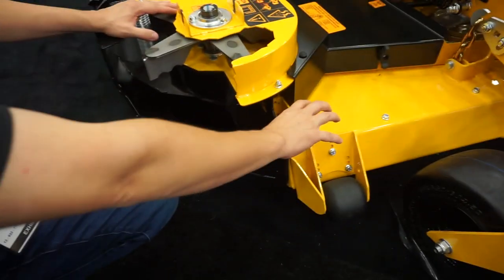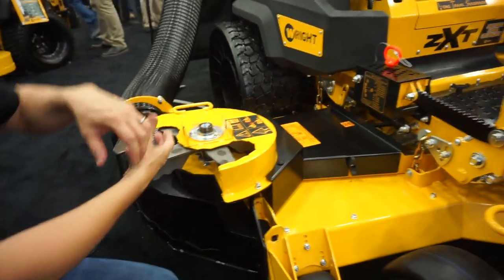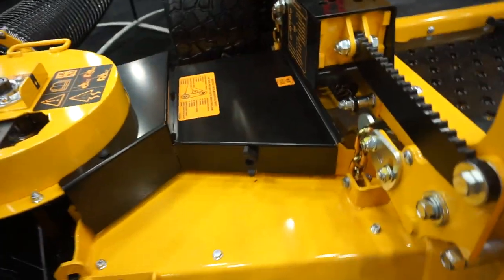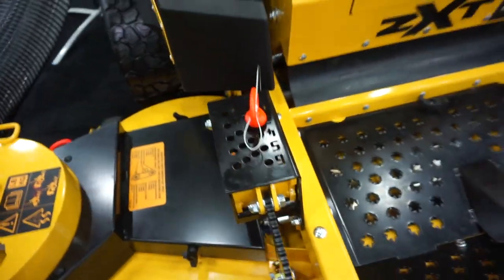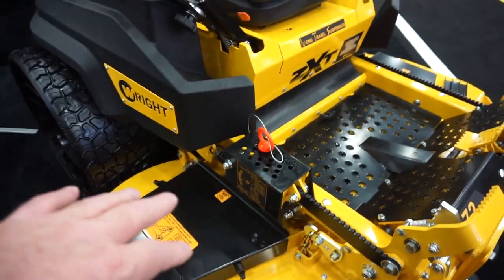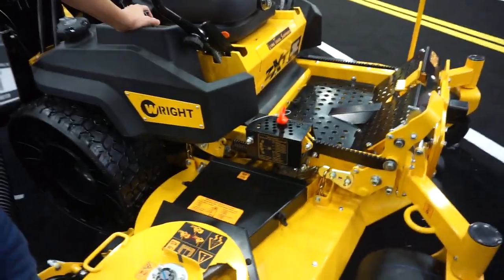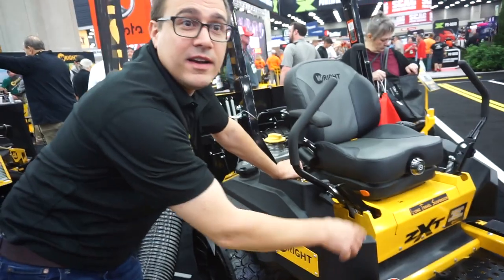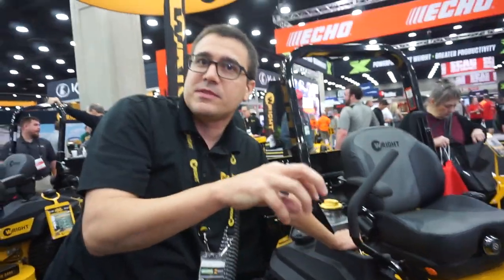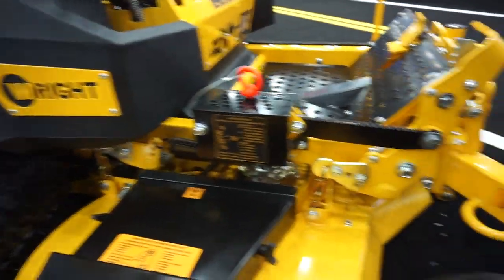The impellers are corrugated and the diameter is sized so they don't plug. It's really important to maintain the momentum of the grass as it's traveling — if blowers redirect the flow, you have to use engine power to change the direction, which puts drag on everything. There's also a drop pin with a retainer so if it does pop out it's still retained. The numbers are cut in — no stickers to come off — and it's easy to see which way things are going.